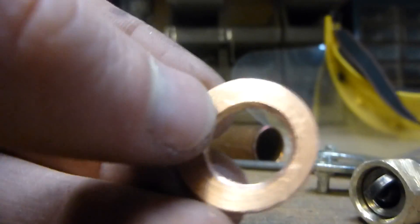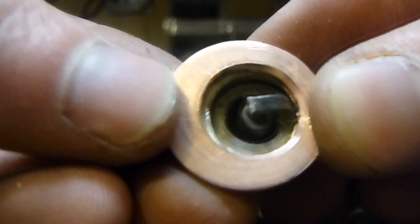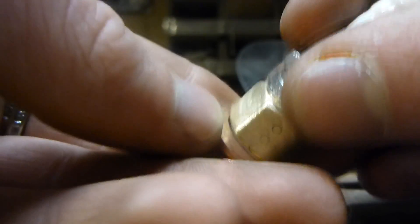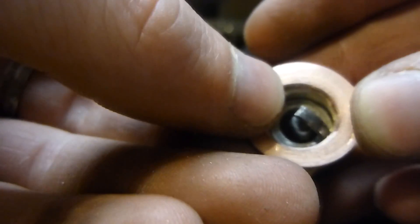Well, the ring or the head sure didn't turn out very centered, but I think that should be all right. You can see here I'll probably put the spark plug like that, and it should be just fine — it does match the size of the pipe real nice, so that's a perfect fit. Now I just have to solder my spark plug holder nut on there, and then solder it on the end of my cylinder, after I calculate my cylinder size and everything, and make my piston. Yeah, that looks pretty good though. I'm happy with that.